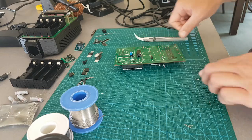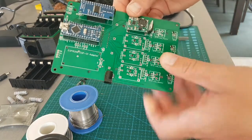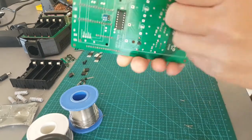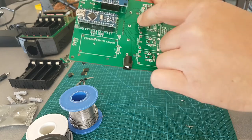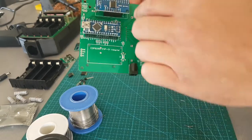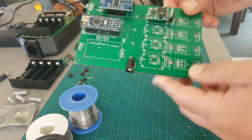Okay, the next day — back again. Just going to put in the Dallas temperature sensors at the top. So now we know what the issue is with the P-Channel SOT-23 MOSFETs. I'm just going to have to use the TO220s. That's okay.